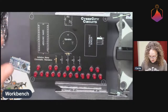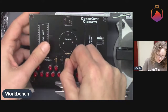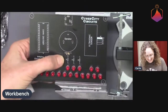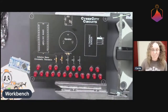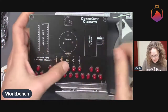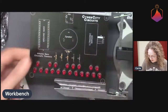Until we actually get the LEDs in hand and put them on the board with the resistor that we think is going to be good, it's always hard to predict how bright they're going to be and how things are going to look when it's all said and done. So we like to reserve the right to change the LED resistor value at the last minute. And so we have not committed to writing its value on the circuit board, but we have committed to writing the values of the resistors that are 10K and not going to change. So that is how we're handling that. And we'll also, of course, have some assembly diagrams online that show you what everything is.